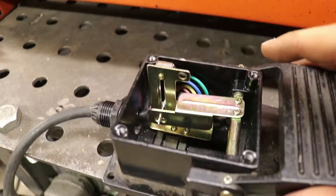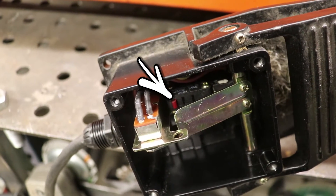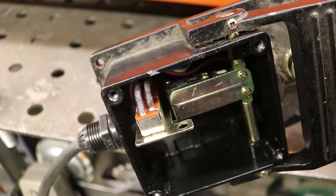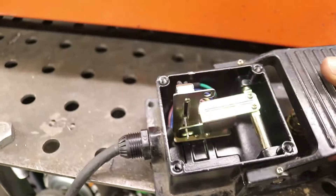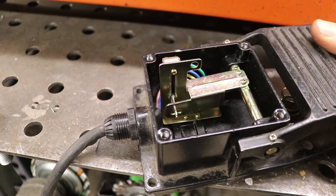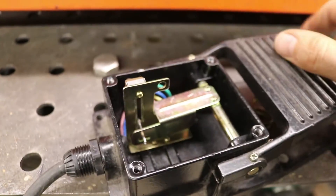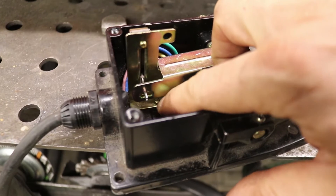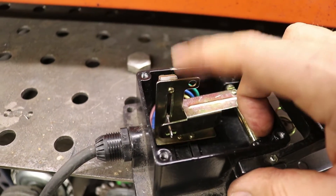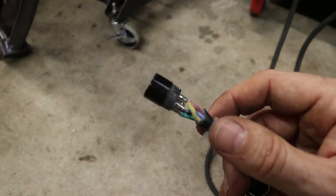My problem was the foot pedal. So I took the foot pedal apart and I found inside the foot pedal we've got a switch down here. You can see that little red button there and you can hear it click. When you put your foot on the pedal it opens up that switch and allows the circuit to go through. Then over here we've got this little potentiometer that's supposed to vary the amperage. You can test these things, and you can also test it over here on the other end where it plugs into the actual machine.